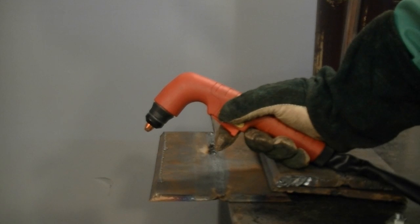We're going to set this unit up to cut at about 40 to 45 amps. This plate is about a half inch thick with the weld — the plate itself is actually 3/8" — but we're going to be cutting down the center of it. It's going to be a good workout for it around 40 amps.